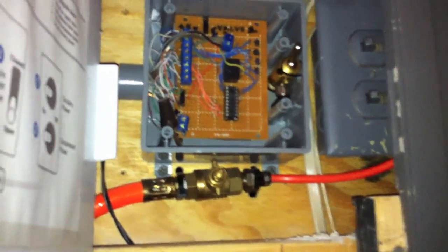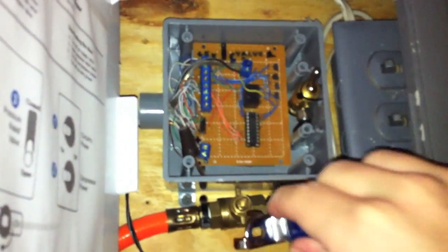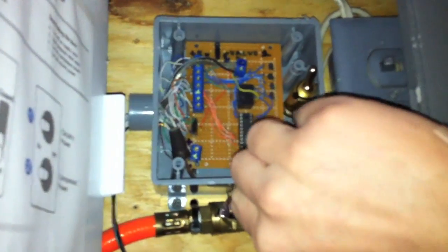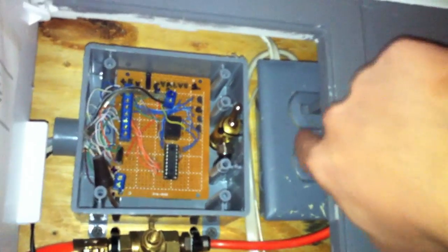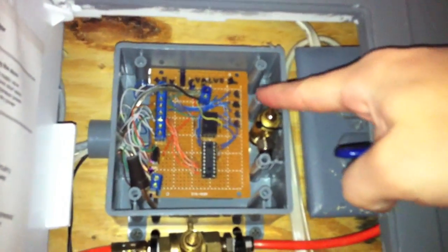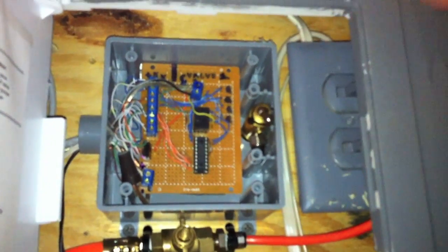Now I'm going to disable the air supply to the door. First I insert this tool and I turn off the valve. Then I turn off all the power to the system and then I vent the air supply. And now I can open the door manually.